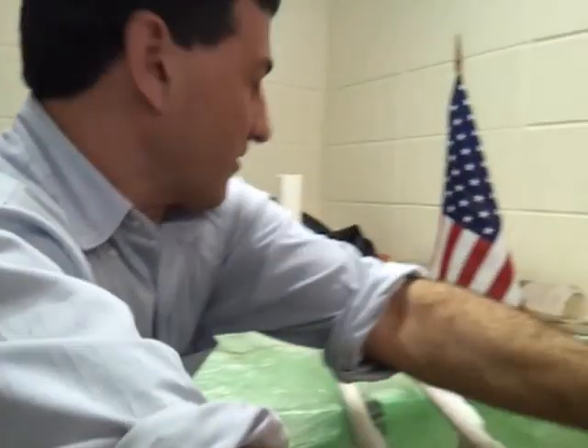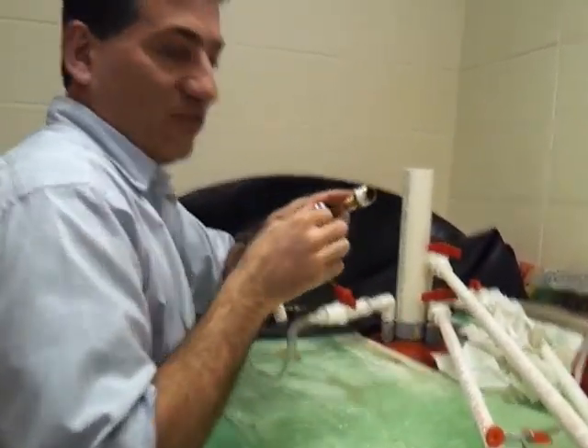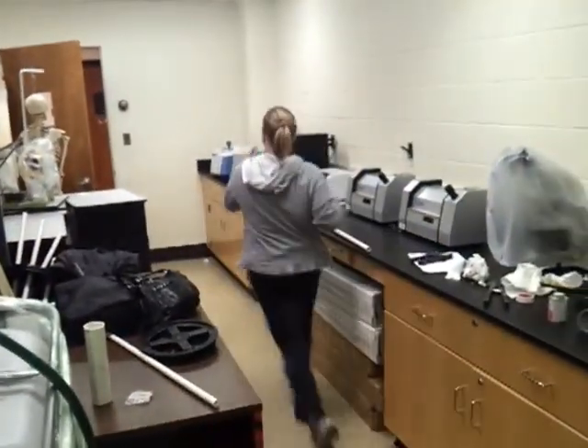I'm going to put more water — that should force some of the gas out. We'll turn off the light so we can see it better. So there we go, look at that. And that's about today's yield. You can see there's still a flame here. Now what you should see is something which I call the burping effect. Sometimes what these reactors do is, every five seconds, there's a pulse of methane if it stays lit.